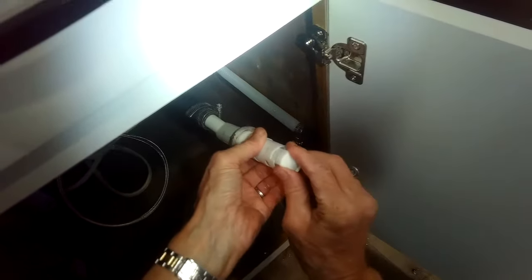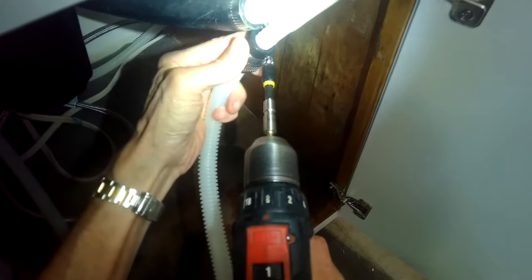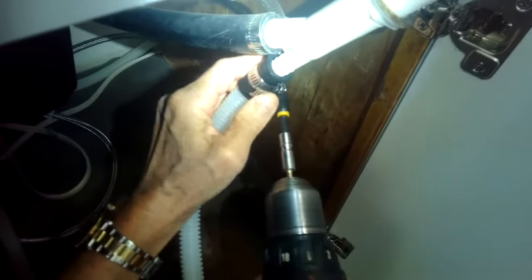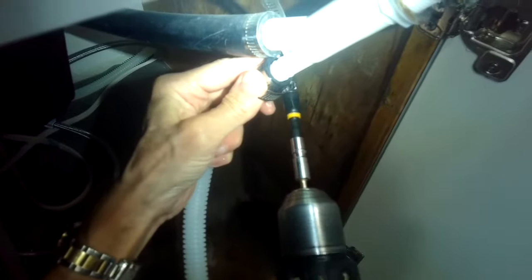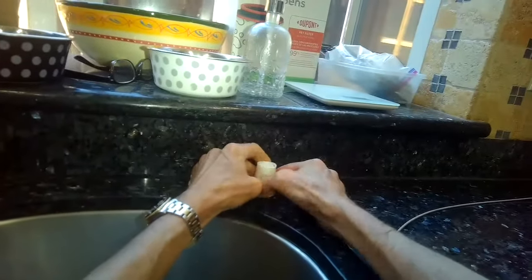I'll put the cap back on and go ahead and put the hose back on with the hose clamp, then tighten it up. You don't actually have to take the air gap out from underneath the counter like this — it just makes it easier to get to these hoses. You can do it all from underneath the sink. Get that nice and tight, and then I'm going to push the air gap back up through the hole. Many times just doing the procedure from the top, as we saw earlier in the video, is all that's required. You probably don't have to go to this extra step of taking the hose off, but just in case — we want to show you how to do it.